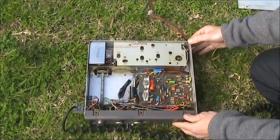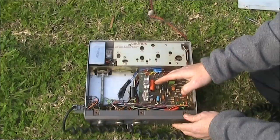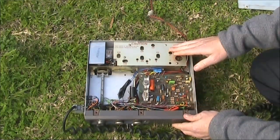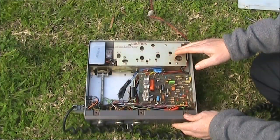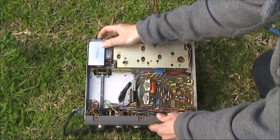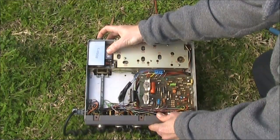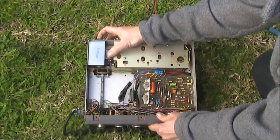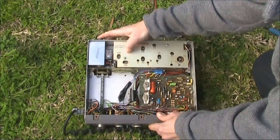Underneath there's much less. There's some audio power transistors here — I think this is for the receive audio board. And in here is the final amplifier, as well as the driver and probably also the pre-driver for the transmitter. This is likely a band or low pass filter connected straight to the antenna connection, and right next to it is the transmit-receive relay. Because connections generally need to be kept short, I'd say the power amplifier would be right here.